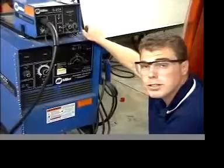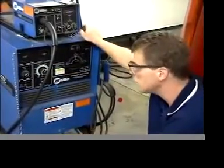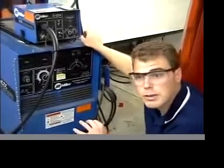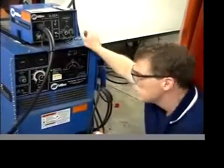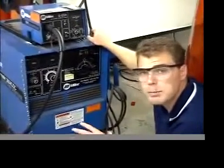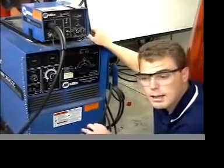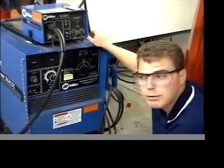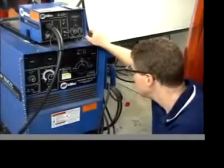In your handout, it says to start around 26 or 25 amps, or sorry, volts. And this particular material, that was for the thicker material. This particular material, you probably want to start down at about 24 volts, so that we don't burn through it right away. We can turn it up a little bit. You're going to have to optimize your settings for your particular part. Practice on a scrap piece. You can pull a scrap piece out of the scrap bin and practice on that first. Try to make the piece that you're practicing on the same thickness as your padding plate.